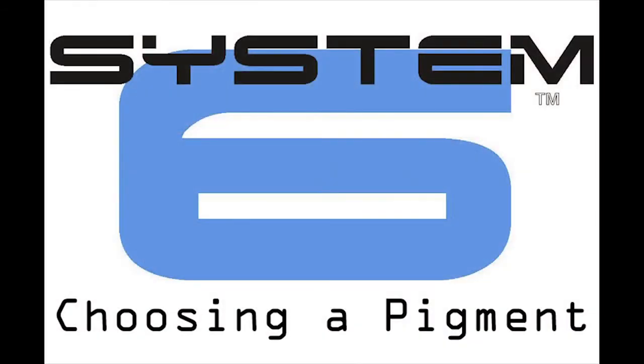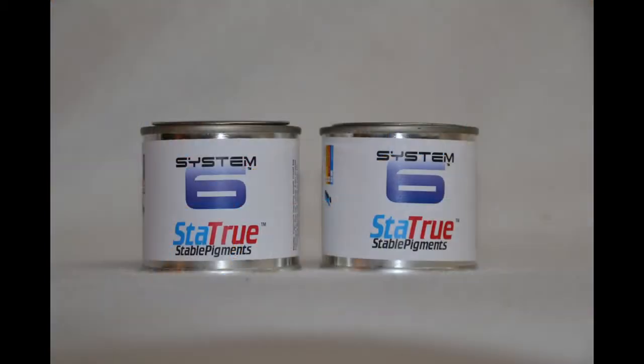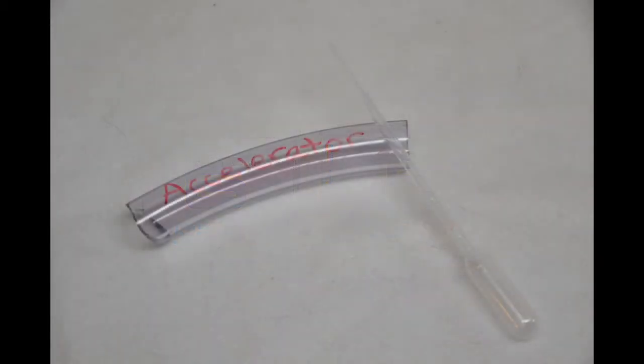Using System 6 allows you to add colors to blend to the pre-existing material, or to add accents or designs. The Stay True colors are a range of pigments that have been engineered to provide exceptional stability and color fastness. In addition to including the most popular raft colors, they also can be blended to match custom colors. Tinting white is a lightening agent for use in customizing colors, perfect for matching other system's color fades. In small quantities, you will measure your Stay True colors by weight. If you are pushed for time, you may have ordered System 6 Accelerator to speed up the curing process. More information about Accelerator will be covered later in the Cure stage of the video.